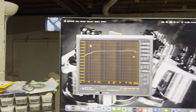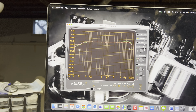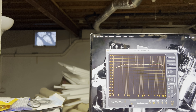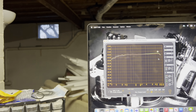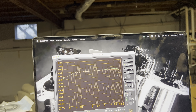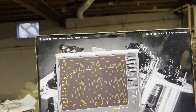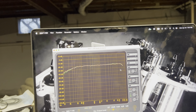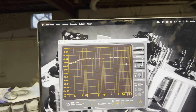Okay, it gets higher - I would probably adjust the bias a little bit on the left channel to make it even. So on normal tape, let me get that - too much - like that, so it would be even on recording. And now Dolby S.